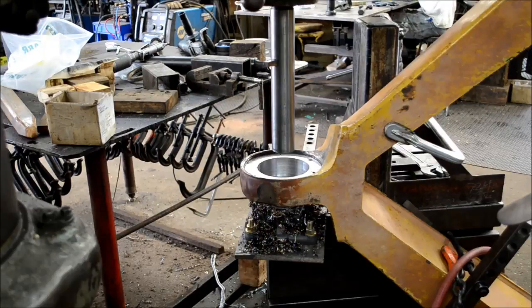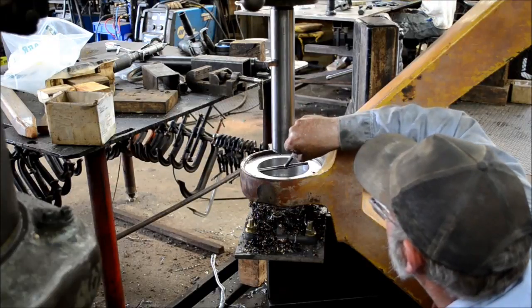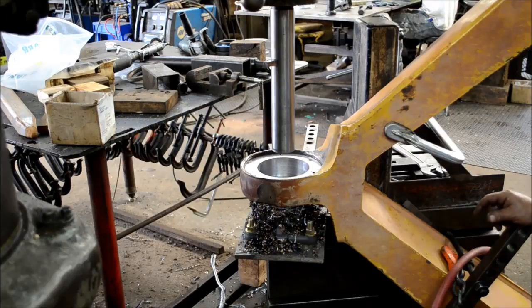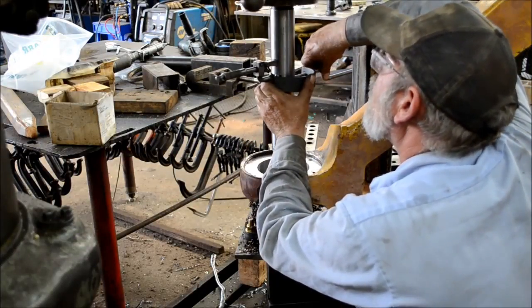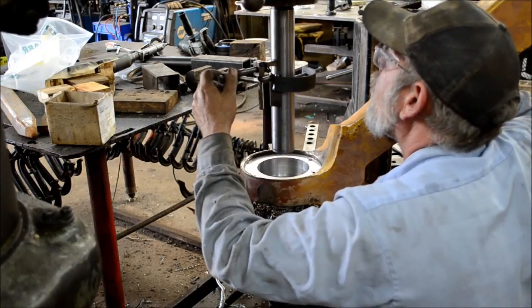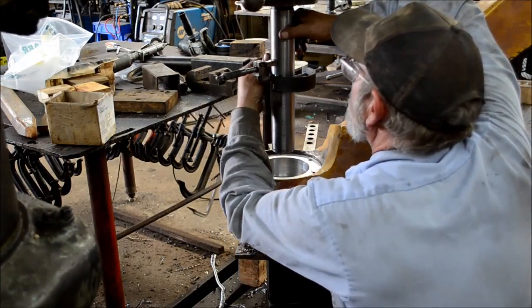Then I'm using a micrometer to see what my reading was. Now I'll double check to make sure I've got a good feel on the telescopic gauge. I've got to figure out how much to take out. One thing to keep in mind: my little homemade tool just measures how many thousandths you move the tool. So you only adjust for half the amount you want to take out of the bore, since you're taking out of the diameter and this is reading the radius.